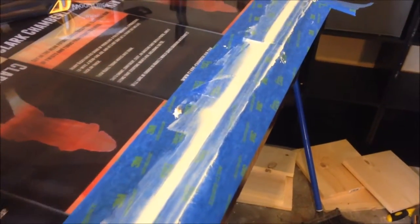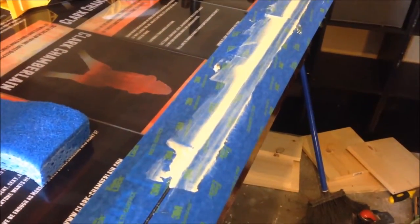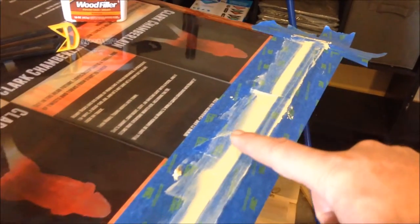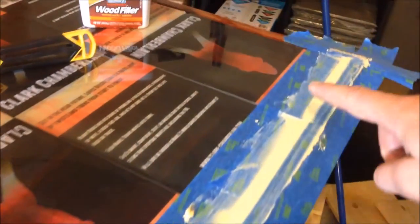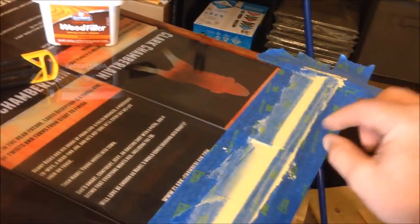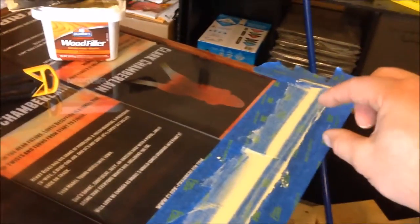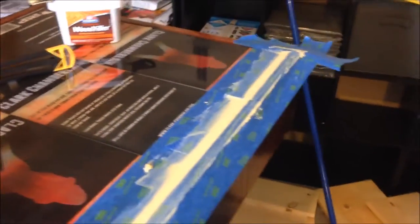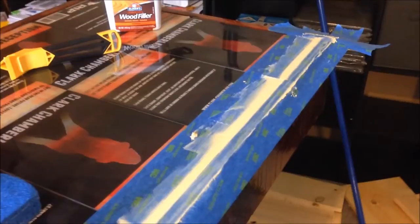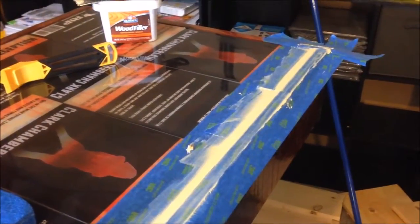The second thing that I should have done before pouring was fill in this crack. I thought that I would have been able to pour in enough epoxy that it would fill it in itself, but now I have a crack that was right across here, and it was just a small edge dividing on this one side. I should have filled this in before pouring, because it just didn't have enough. That was just too deep of a gap. It was an inch deep, and the epoxy only does a half or an eighth of an inch at a time. So now what I've done, I tried yesterday to fill that crack with a clear silicone, but it didn't interact very well with the epoxy top.